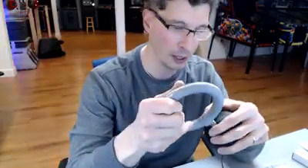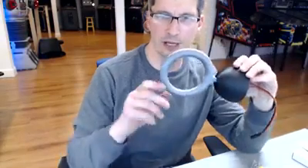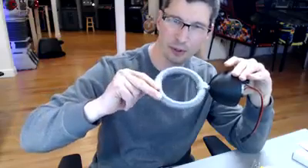Now you want to put some pressure down and put in a 10mm screw through the top here. Alternatively, you could put a dab of glue on the end if you're doing the glue version — or both. I like to be able to take things apart, so I'll screw that down. Done — and now if I turn this slowly, you should be able to feel the motor turning. Now we're getting somewhere.